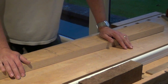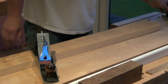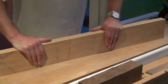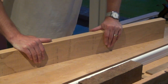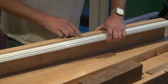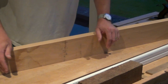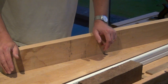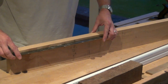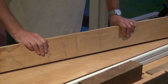The only cutting tool I'm going to use to do this is a jack plane. I would normally be using my number 5, but since I recently picked up this low angle jack, I'm going to try that today. Now I'm not going to be preparing this piece of material in this video - we've already seen it's got a big bow in it. Because I don't yet know what I want to make from it, if I take that bow out, which looks like at least an eighth of an inch of material will be wasted, I may end up snookering myself. One of the first things I like to do before I prepare the lumber is to decide what components I want from it. If I was going to use a short section of this board, checking with a straight edge, I can see I'd only lose probably less than a 32nd of an inch making that flat. So until I know what I'm going to make from it, this wood's just going back in the stack.